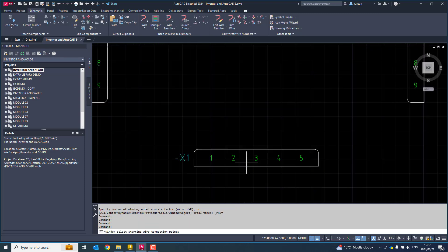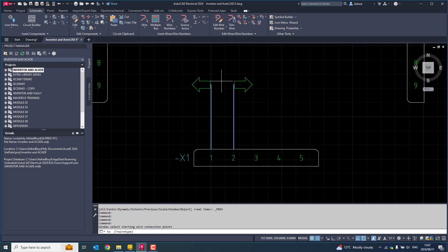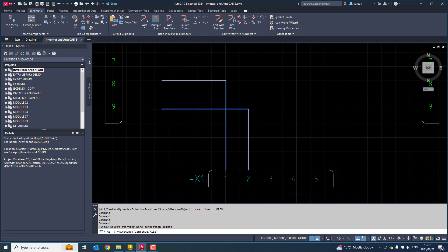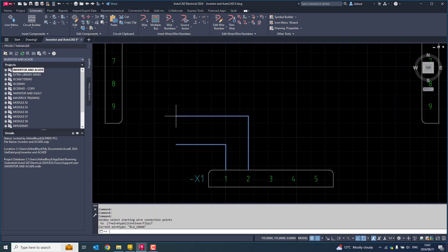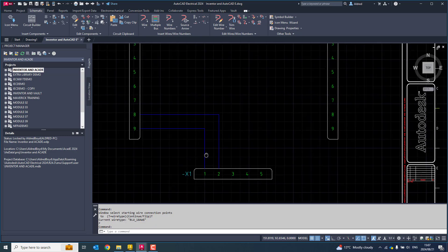When I do this, I'm going to select those up and bring it over. One thing I need to make sure is that the name of the layer or the wire layer here is exactly the same as the name of the wire inside Inventor. So if I press T for wire type, you'll notice I've got blue_18AWG, red_16AWG, and GRN_14AWG. I've created those same wires inside Inventor so that the two can talk to each other. I'm going to make this blue.